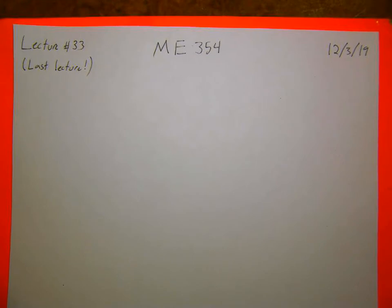We can use the stress to get a rough ballpark of what strain we should see in the far field of the sample. So if I were to apply 131 MPa of stress — which is right at the start of the plastic zone — I would expect to see about 0.2% strain. That happens at a time of 36 seconds, so if I pull back now to the DIC plot, 36 seconds would correspond to about 13 seconds. The far field stress you see is noisy — DIC is a noisy method — but it's pinkish-white, which correlates to around 0.1 to 0.3%.